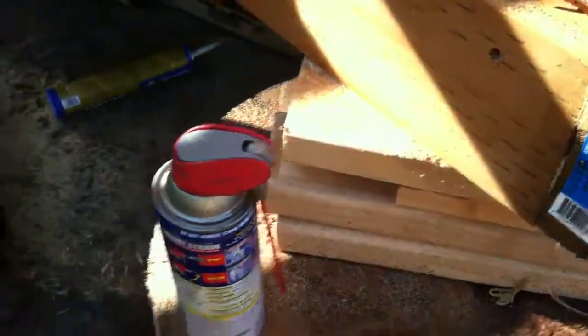Here I've added another shim. You can see how the footprint of the jack sank a little bit as I was jacking this corner of the building — and that's essentially what's happening on a less severe basis with this piling sinking a little bit.